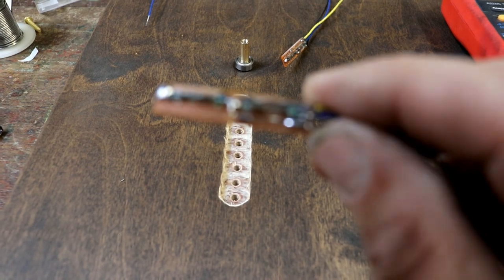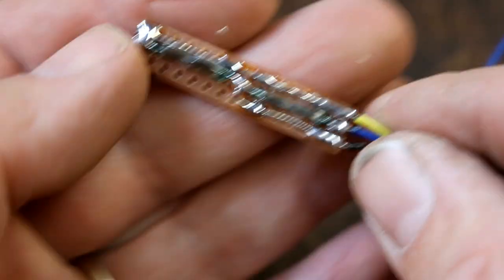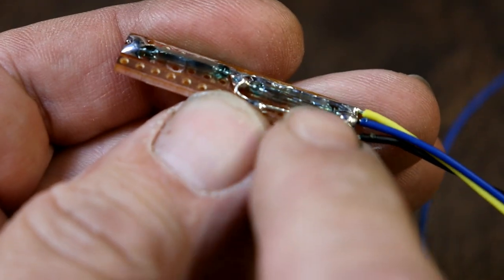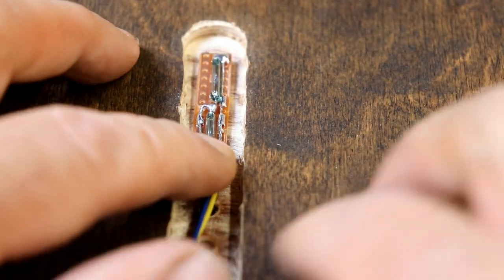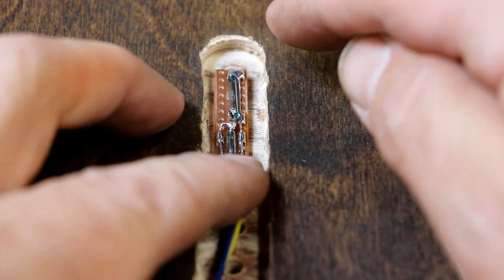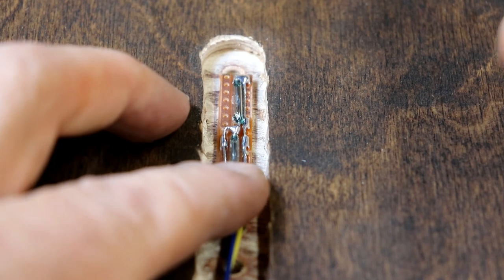Now what I'm going to do now, this is what I made up. Look, a right old mess, but what they are is two reed switches. When I say reed relays, one reed switch there, one reed switch there. I've soldered them onto a bit of veroboard because the idea is they are going to sit in here and line up with the magnets. Originally, in the original climatic revelator, I had one magnet on the base, on the carousel, which lined up with the datum scene, which I think was changeable weather.